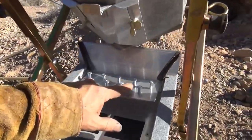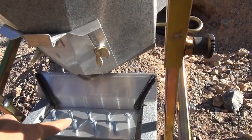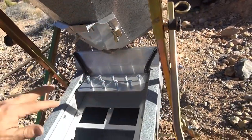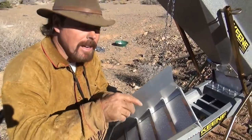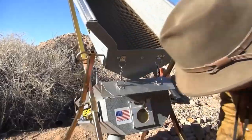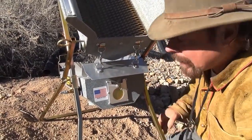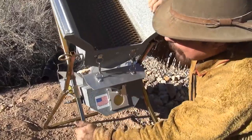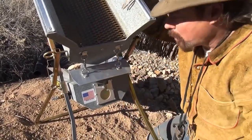See these little tiny pins back here? Keene Engineering realized in the old days that material would drop down and beat on the top of the box, putting holes in your matting. So they put this block here to diffuse all the material, and these little pins disperse the material so it comes across evenly and goes into the top of the riffle tray more evenly. There are also bump stops on the side of the box — one on each side — that hold the lower tray box in place. They put a bigger fan in there with a bigger counterweight to increase vibration, so the box and hopper vibrate together, meaning you spend less time pushing material through the flow gate and across the riffles.